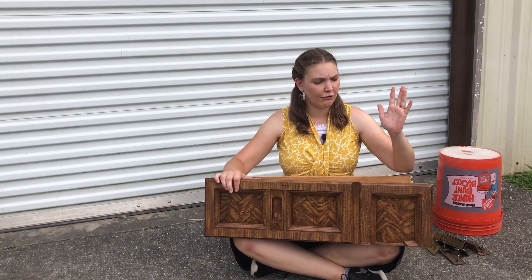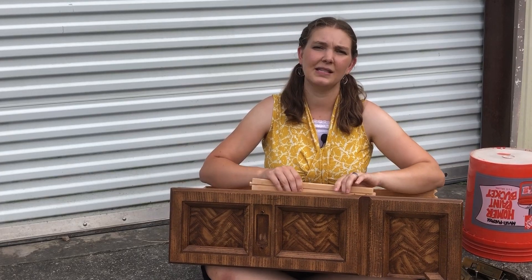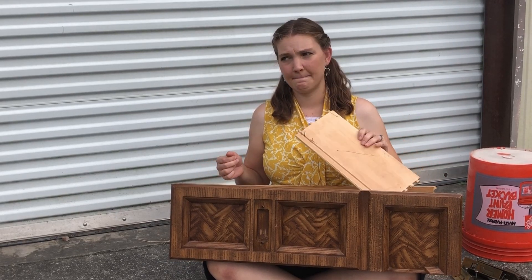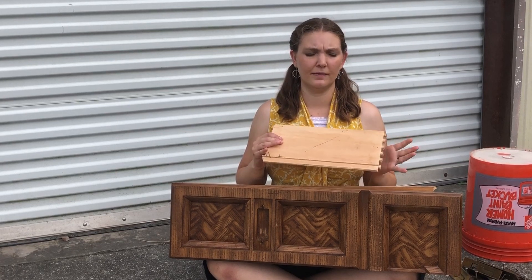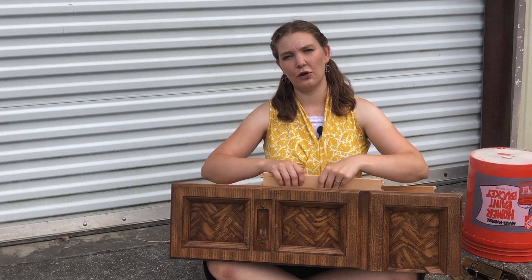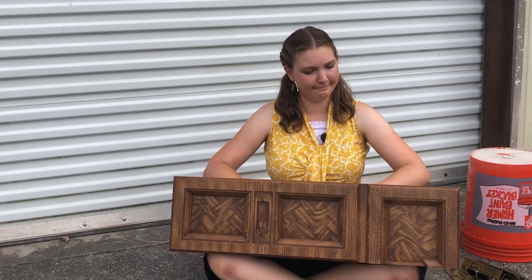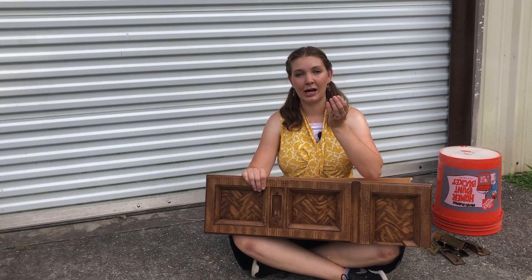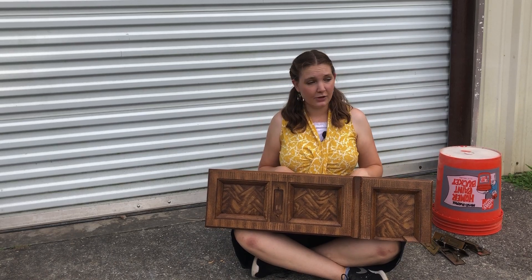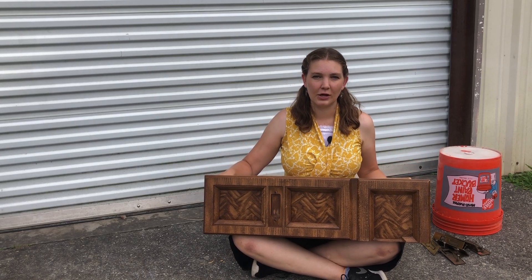While giving your drawers a good clean is a great opportunity to check and make sure they're in good condition and ready for the next people. I found that someone had randomly nailed nails into the furniture — not an appropriate fix — so I pulled it back apart. Before I get too much further on this project, I'm going to be fixing a drawer with a little bit of wood glue, clamping, and some appropriately placed nails. One other drawer had a slide on the bottom that wasn't properly connected, so I stapled that in as well.